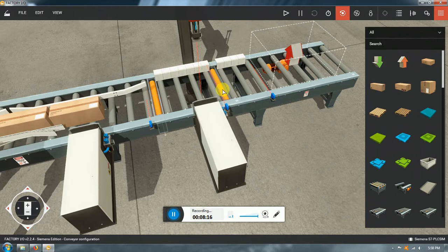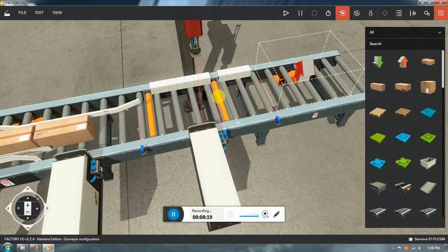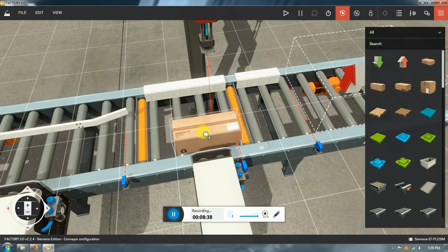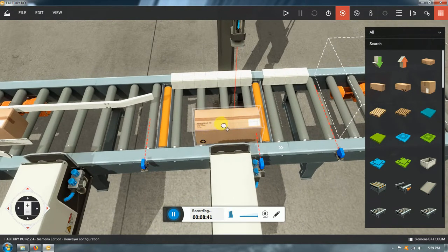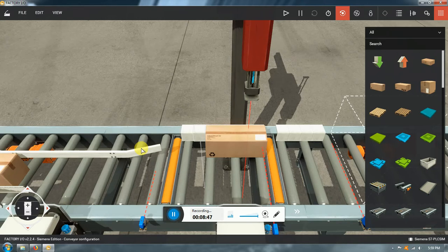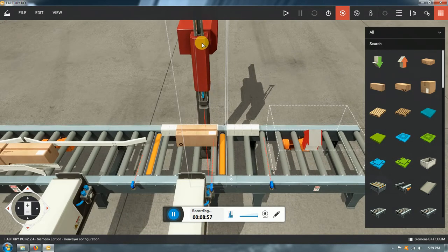Then I have the same thing for the second area, but here things have a slightly different mission. But the stop is the same. Its mission is to stop the box and just stop it exactly where it's supposed to be, lengthwise. The clamp is going to shift this box, sorry, I don't know why I keep saying battery. This box is going to clamp it to the rail. I have to improvise with this rail because the other ones weren't working for this application. So now this box is completely in position, and now the fifth piston, which in this case is the stamper, is going to stamp, boom, the part number.